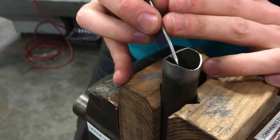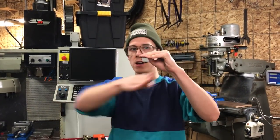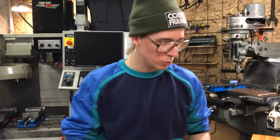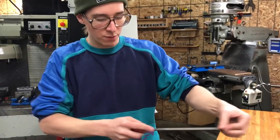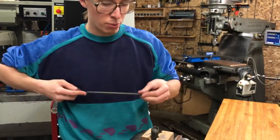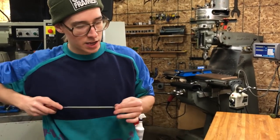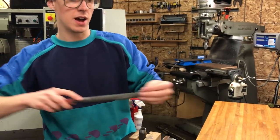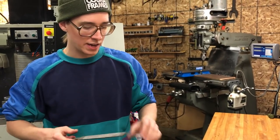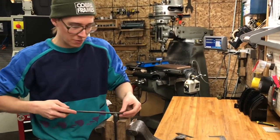So the high spots are right here and here, and then over here and here. That makes sense because the radius of my hand file is for about a 1 inch tube. In order to make it fit against this larger one, I don't just go straight forward and backward. I want to push a little bit to the right side and then a little bit to the left side as I'm cutting, keeping my file moving parallel to the same line all the time, but sweeping out a little bit, expanding so that I'm sort of interpolating a wider radius or something, right? So,